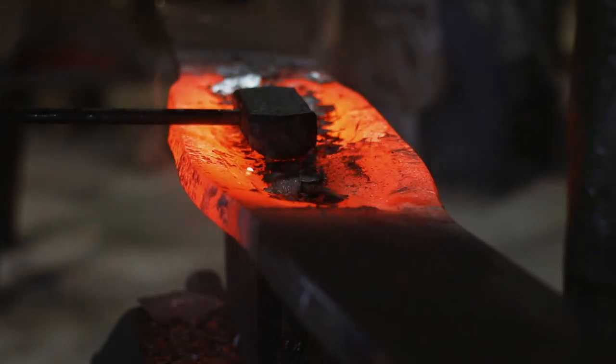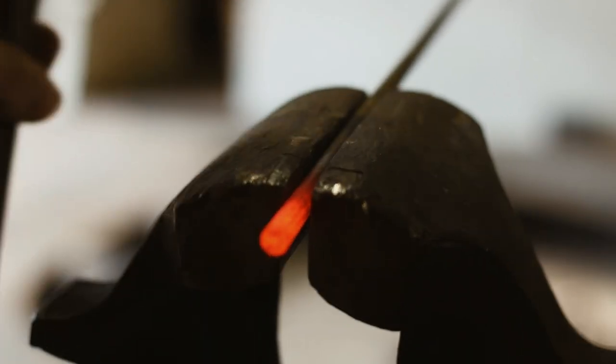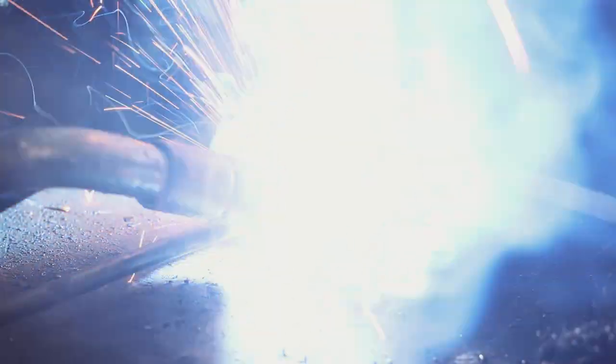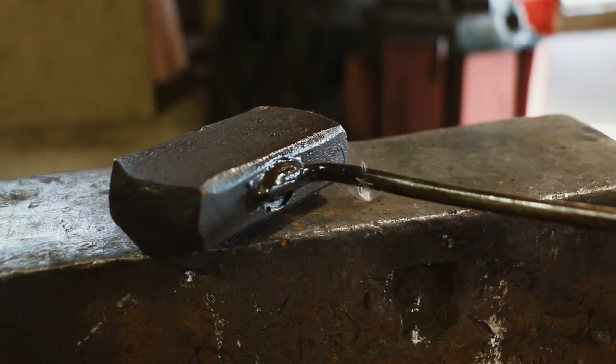It's a great application if it's a big chunk of steel and you just need to flatten it out — really sweet, really nice. The other option is to take just a round bar, quite thin, and bend it 90 degrees. The reason you bend it 90 degrees is so that when you weld it on with your arc welder you get more surface area — just doing a straight weld isn't as good and it'll pretty much just break off guaranteed. The pro of that is it's really quick, and vibrations aren't so bad with that thin bar because it just takes it, and if it gets bent you just straighten it up or you can angle it. I actually like that method — it's pretty sweet and really fast. I'll leave it up to you, but you can go both ways.